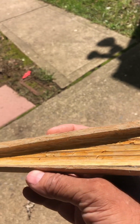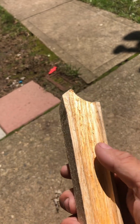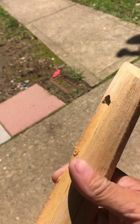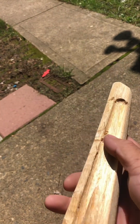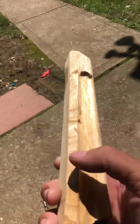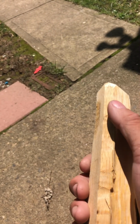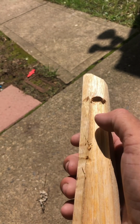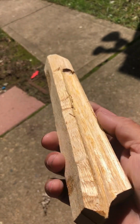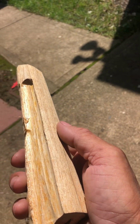I did the same groove here, but then I wanted to run the, oh yeah, right on this side. This is the right side. I wanted to run the machine over here to make a round, the router with the bearing, and the bearing fell inside the groove and ate it all up. So that was a mistake that I didn't want to make on the real thing.